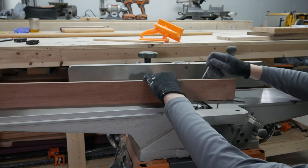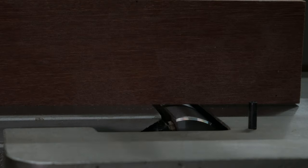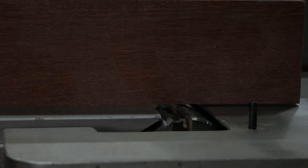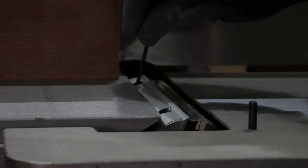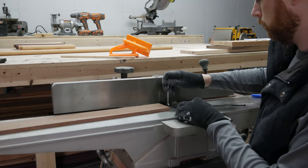From here, you can check the blade's alignment with the outfeed table. The blade should just barely graze your straight edge. Anything too high or low will greatly affect your cut, so take your time and make sure you are aligned the whole width of the blade. You can align your blade by raising or lowering the adjustment screws with your Allen wrench. I typically adjust each screw a quarter turn at a time until everything looks even.